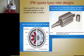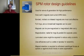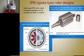kind of a comparison between the conventional IPM that has slabs of high energy magnets in it, but this Fanuc design used slabs of low-cost ceramic magnets, $1, $2 a pound for these magnets, and they have very low flux density. They only put out 0.4 Tesla off the surface of the magnet in a closed circuit, but if you put this soft iron pole piece here that's punched out of the hole of the stator core, so you get these essentially for free, other than the cost of the dies, you get them for free.